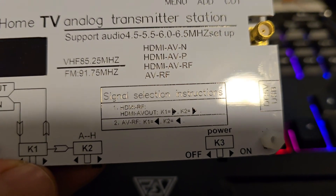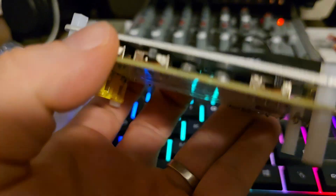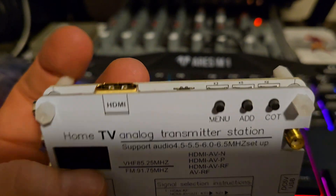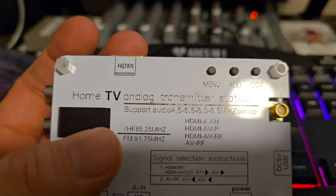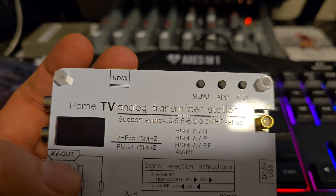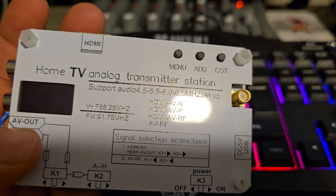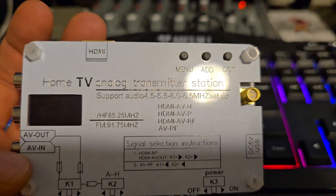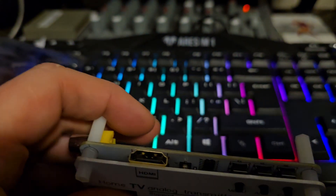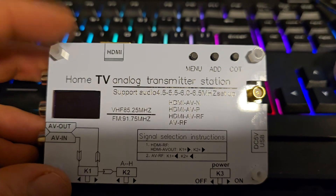To do the HDMI to RF, or HDMI to AV out, you put K1 and K2 to the right. I'll go ahead and toggle that now. That basically just tells the board we're not taking this input signal and broadcasting it to RF — it should be HDMI, and that probably simulcasts to this AV out but also outputs to RF. So technically you could have a monitor on both channels. It does have some dongles up here with some functionality I'm not totally familiar with. I'm hoping this is mostly plug and play. We're going to go ahead and get the HDMI from monitor two plugged in, power it up, get the antenna screwed in, and hopefully get this broadcasting.